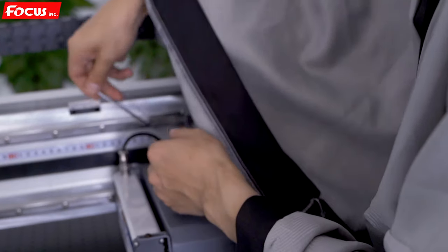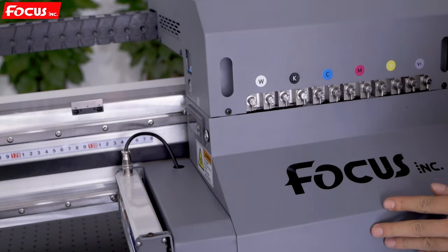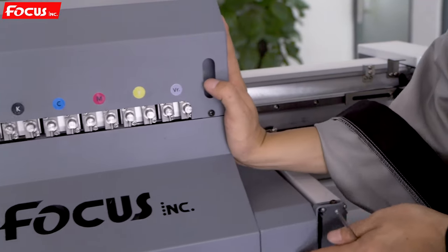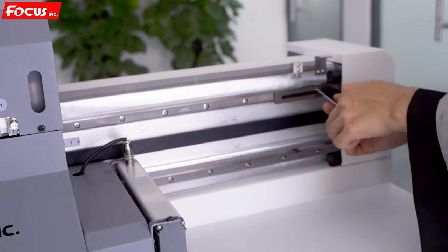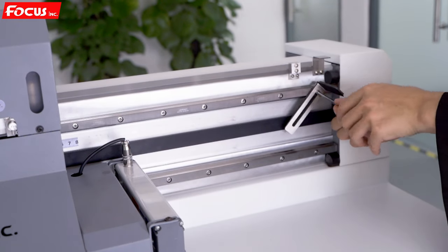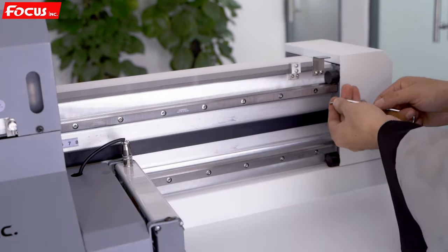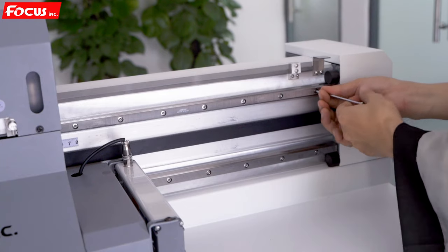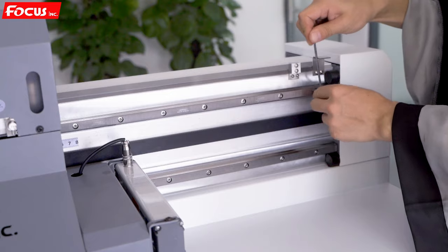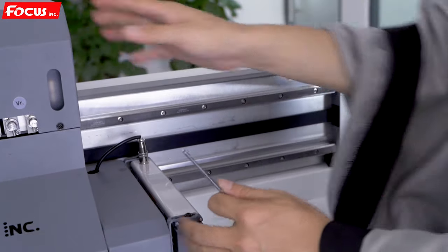After fastening the screw back on the rail, you can push and release everything from the table and push the carriage to the left. You will then see the second protection metal bracket on the other side — you need to loosen it as well, take out the screw, and install the screw back onto the rail.